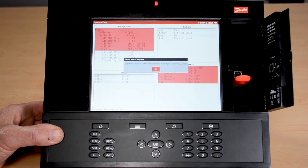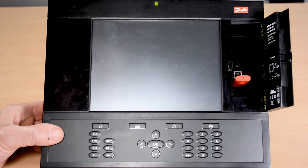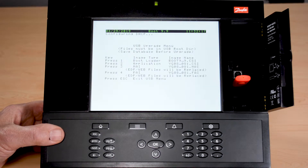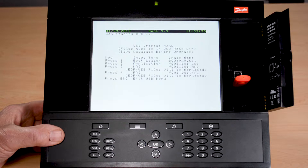When I reset the controller, it will go into boot mode. Boot mode is a process managed within the controller that does not allow it to finish booting into normal operation. It goes into a screen that looks quite different — a text-looking format. If we are in boot mode, this will be the screen we're in. You can see options press one through four; we are limited to upgrades only here. We cannot do other functions like save database or load — under boot we are simply doing an upgrade.